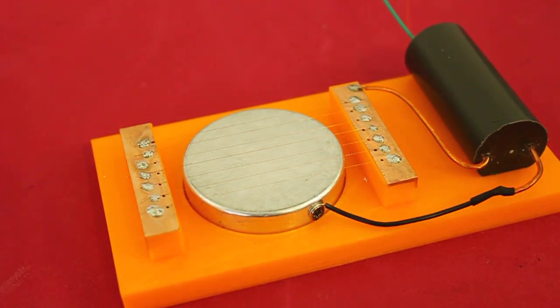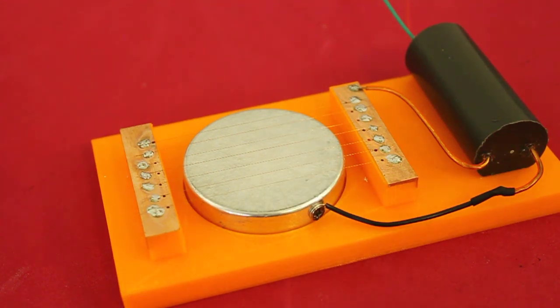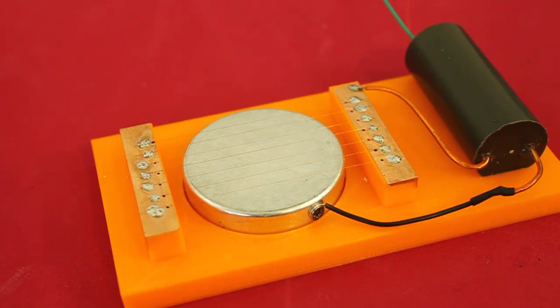Let's see how this device works. It is actually very simple. We have a very high voltage between the cathode, the base, and the small wires. But it is not enough to break the dielectric capacity of air, so the spark does not jump. But now, the alpha particles emitted by our source ionize the air when they pass, and the ionized air is more conductive than normal air. So when an alpha particle passes near one of the wires, the air is ionized and becomes more conductive and the spark can jump between the wire and the cathode.